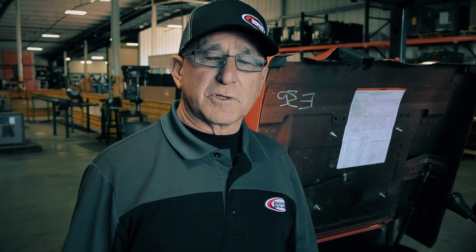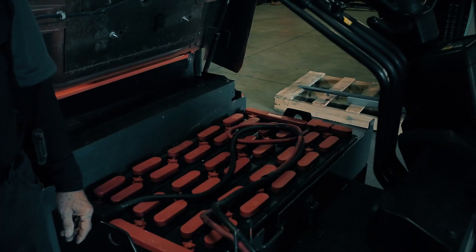We now come to the why portion — why do we water a battery? Inside each cell are two liquid components, and also plates or tubes on a flooded lead acid battery. They both require a proportional amount of water and sulfuric acid — that is called our electrolyte. As long as they are in balance, our battery performs as it should. When our electrolyte gets out of balance, our run time is greatly diminished. Water is as important to a battery as it is to a person — we must keep the battery hydrated but not over-hydrated.